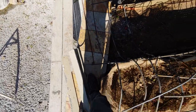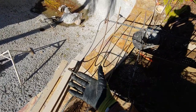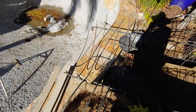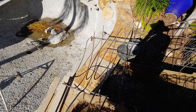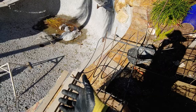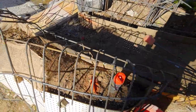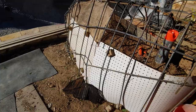There's no point putting a foot and a half of concrete in there if we don't have to, and we need to get rid of this dirt anyway. We're going to be floating it out just to the edge of the pool — these rebar ends will be bent over or cut off. Underneath, these are the ribs of the slider. We're going to put a piece of plastic underneath and a piece of foam in front of the coping edge — we don't want the slide expanding and contracting at a different rate and causing bond issues. On longer slides I like to put a slip sheet underneath. We'll put pegboard on the outer side and pre-pour that section before the shotcrete company comes in to blow texture on everything.